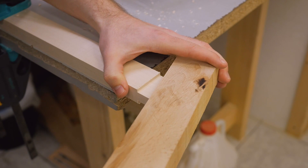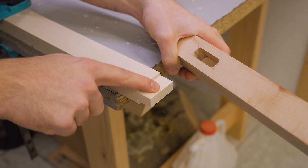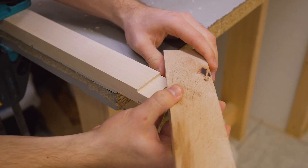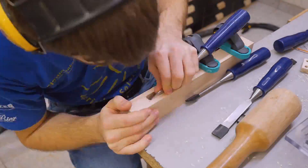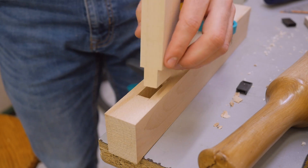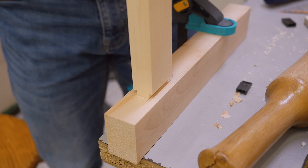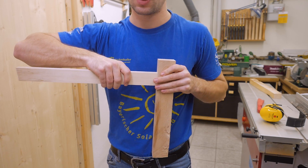Yes, seems like I got lucky. Actually I wanted this to be too tight so I could adjust the depth of cut and make a second pass, but that's pretty good. Then again some chisel work to make the mortise square. And it plops when you pull it apart.